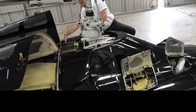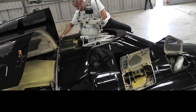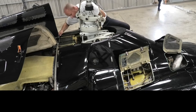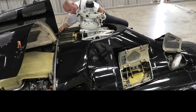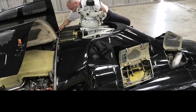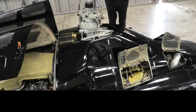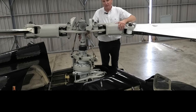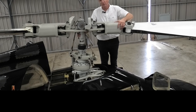There are three oil coolers along the back here — we just want to check that they're clear. There's a little bit of debris in these, but we're checking for any leaks on the oil coolers themselves. A quick check around the back of the gearbox — looking for obvious wear, chafing, leaking, etc. — and everything appears to be exactly as it should. So pretty much that completes the pre-flight check for the Bell triple two. Any questions or comments, please feel free to contact us, and the next one to look forward to is the start-up.